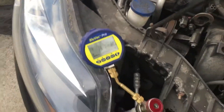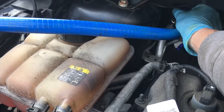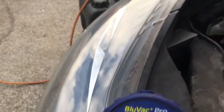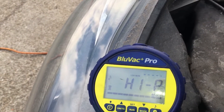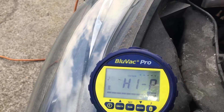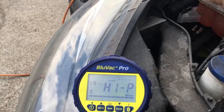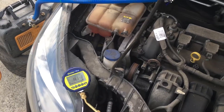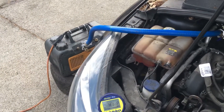The vacuum pump is on. I'll reach over and turn the valve in — watch this, we'll hear the difference on the pump. There it goes. So we're now evacuating through one single hose on the low side, bringing down the vacuum on the entire system. The only way to get your true micron reading is being located at the furthest point away from where you're evacuating.